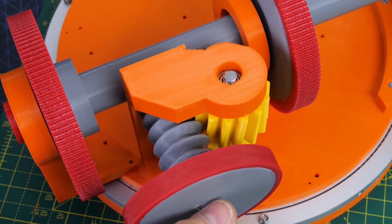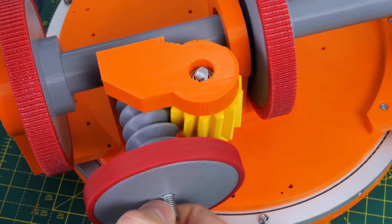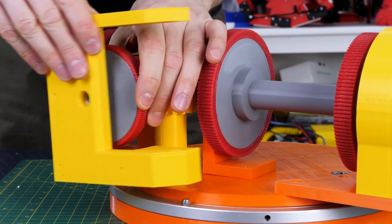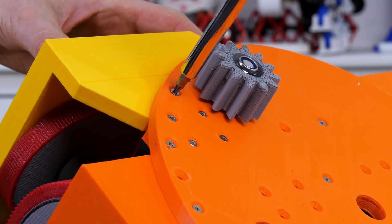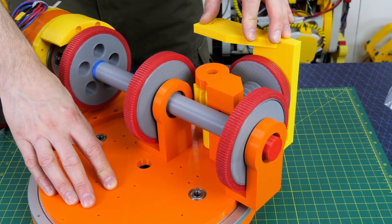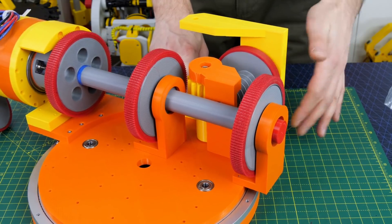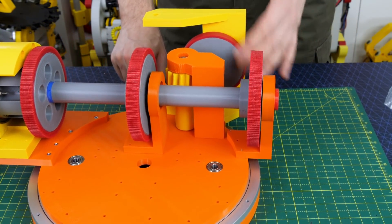You can see the worm teeth aligning with that slanted spur gear so that will rotate round once we've fitted the ball. The ball fits onto another bracket which also holds the other end of that worm gear with its rubber tyre on - that's just screwed on from the bottom as the other parts are. All of the gears in here are slightly loose so there's not too much friction; that does mean there's some backlash but it's not too bad. As we rotate that big wheel we can see it driving the worm gear, driving the spur gear, and driving the whole thing around.